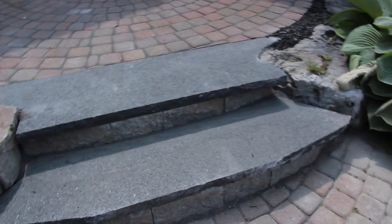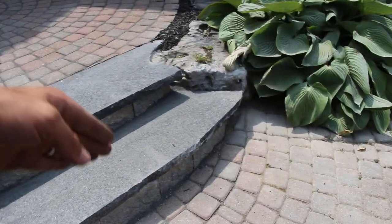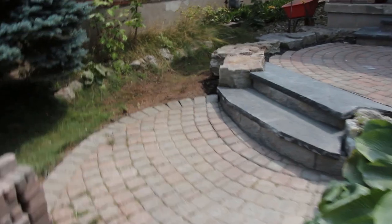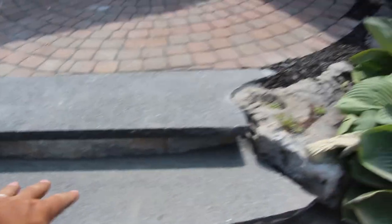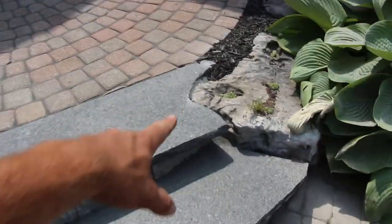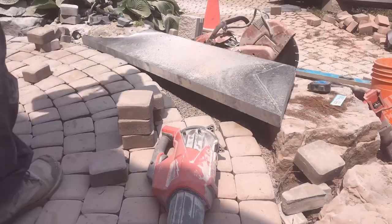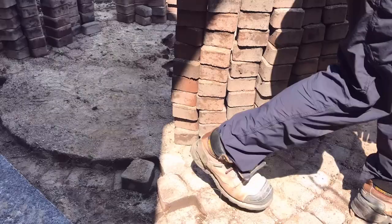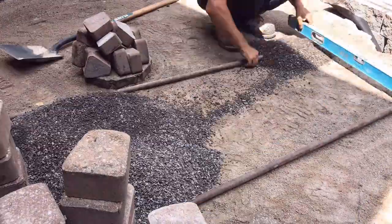Here's the final product. Initially I was going to make these steps straight, but coming up this driveway the entrance would be off to the side — you'd have to come up and then come this way and then enter. Keeping this curve here opens it up so you're coming up the driveway and can step right up onto this. I tried to cut it to the stones — this is 16 inches minus — we actually cut a curve to match this wall and this step. It's a nice curve all the way. We cut along here and chiseled that to get a nice rock face all along. This landing was built completely on stone dust and we all know — if you follow my channel — I hate stone dust.